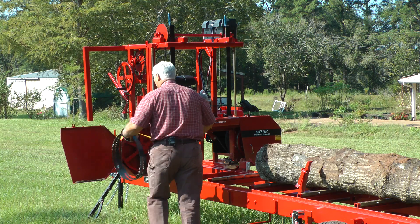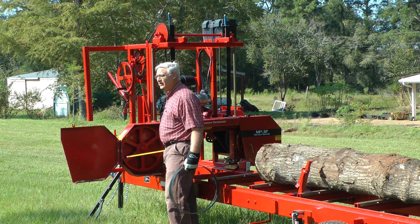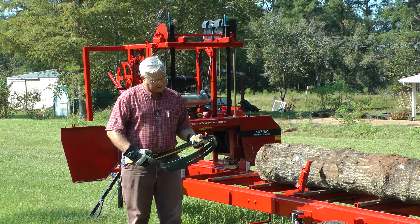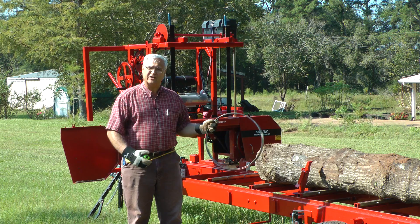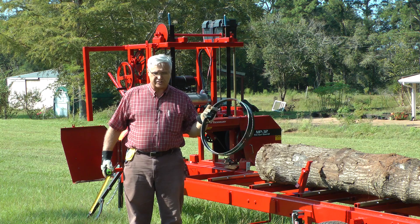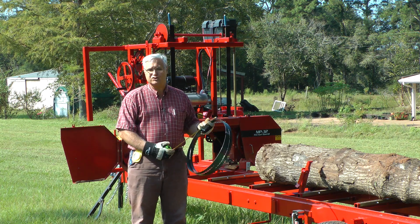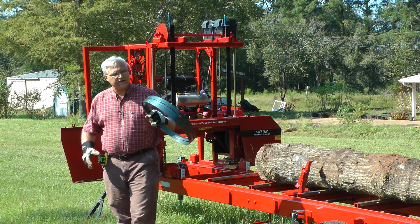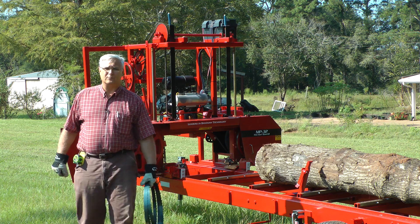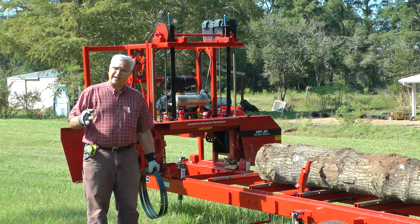This MP32 is a 19-inch band wheel. The first thing that comes into my mind is the diameter when we actually have a blade rolled up for shipping that would go on this mill. This is a 14-foot blade, and as I measure this, we're 18 inches right there. So this thing is being shipped in a smaller curve than it is on the mill. Obviously, when you're on the mill you have tension, so that comes into play.